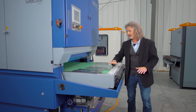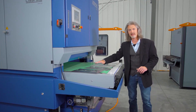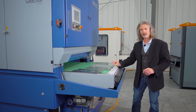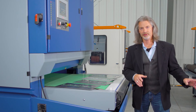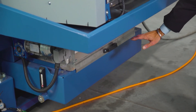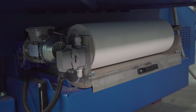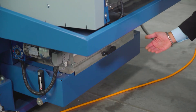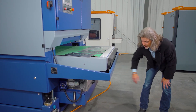Let's talk about the in-feed table. This in-feed table is what we call a constant pass line. When you put a part through this machine at this height, it's going to stay at that height regardless of the thickness of the part. Some machines have a table that moves up and down to accommodate different part thicknesses, but with a constant pass line you would not have to adjust an extension table in the front or the back when you change your part thickness. Down below, we have the filtration system, which is built into the footprint of the machine so it doesn't take up extra floor space. A roll of paper moves through the machine as it fills up with the swarf created from the deburring and finishing process, and a float lifts up to indicate when it's ready to scroll — the machine moves that automatically to the rear.